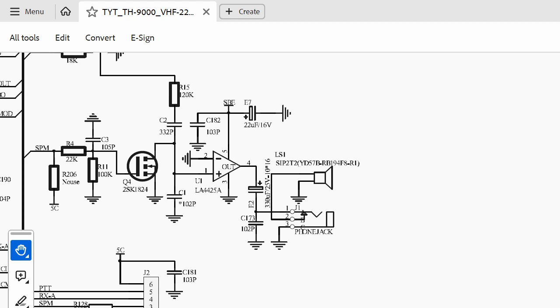Or, if you have no sound, maybe plug in an external speaker to see if you get audio — maybe the internal speaker is blown. That's a nice thing about having an external speaker jack: it helps you troubleshoot. So if I get a radio in with no sound but the display shows it's receiving, I either have a bad internal speaker, the jack isn't switching right, or I could have a bad capacitor or bad audio chip.